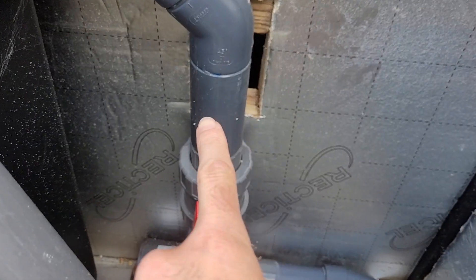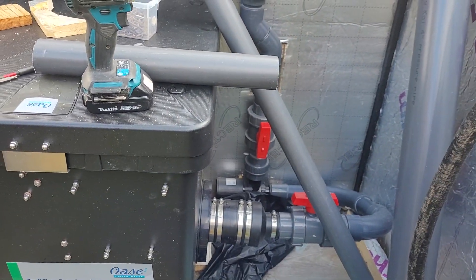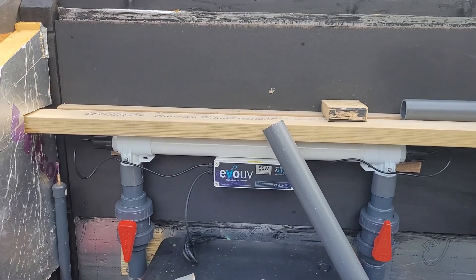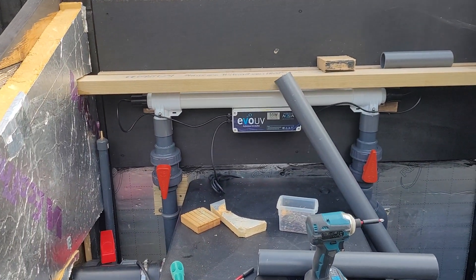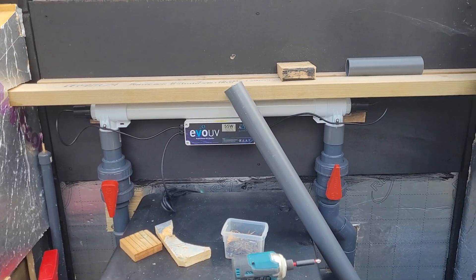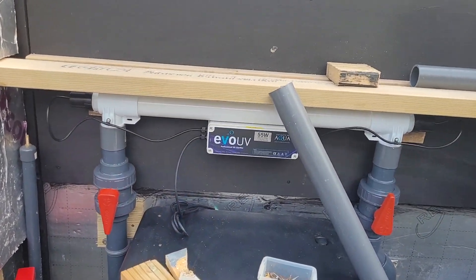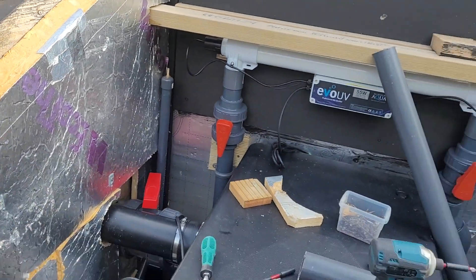Because if I just unscrewed that, the T is lower than the level of the pond, so the water would come flooding back out that way — which is why there's another ball valve down there. The reason I've got all the ball valves there is I can use these two ball valves to restrict the flow going through the UV, and by restricting that flow, more flow will go out the T. My plan is — although the water will naturally want to flow up and through the UV — I want the faster flow through the T. The line off the T will go to the shower.